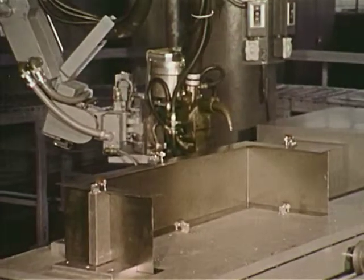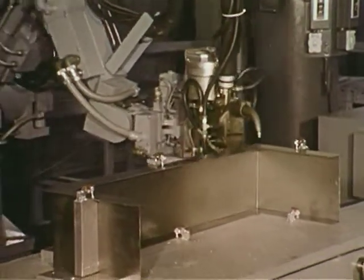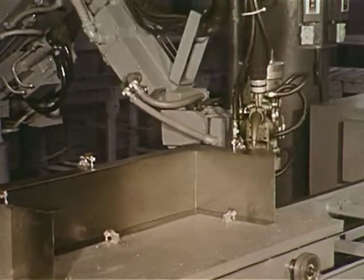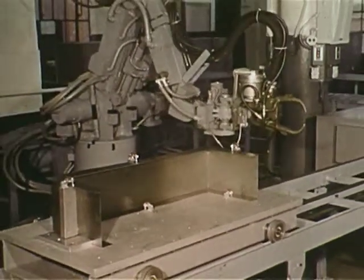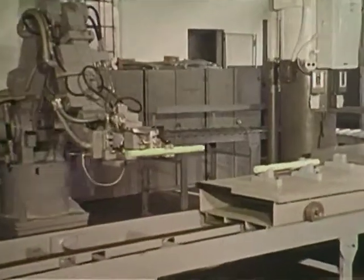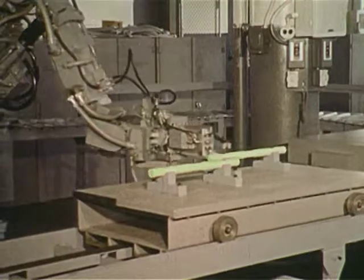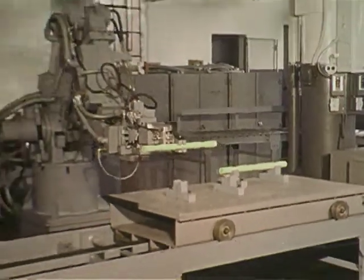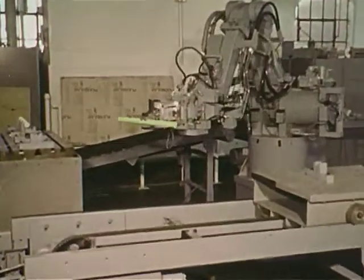It is possible that some operations cannot be performed until a part is in a given position relative to the arm. This information can also be stored in the computer, thus assuring that the part and the arm are in the proper relative positions when the operation takes place. There are many other uses for this feature. Parts coming down a line can be removed, inspected, placed back on the line if correct, or sent to another area if faulty.